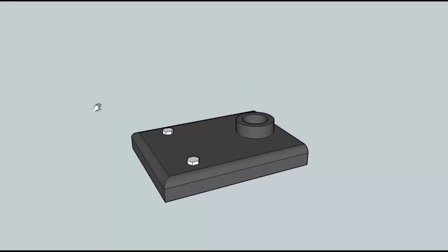The base of the drill press needs to be bolted down to either the floor or to the bench top. Drill presses are top heavy with a lot of weight up on the top with the motor and the head that's up there. Plus you're going to add material to that and you're going to be pulling down on that lever. A drill press that's not bolted down is very dangerous.